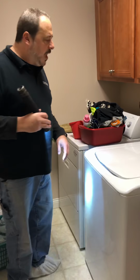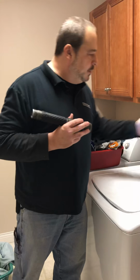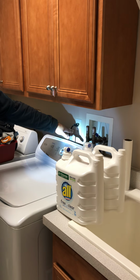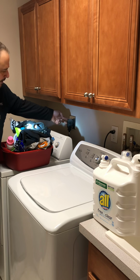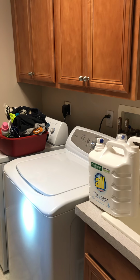We'll go ahead and hit the laundry room here real quick. So I want to make sure that, of course, you do have water flow. If you didn't have these units in here to be able to test, just want to make sure this rotary valve isn't going to be leaking, that you do have actually hot and cold, a grounded outlet, and that there is correct power for the 220. There's going to be 3 legs here. You're going to get 110, 110, and 220 off of that leg. So I would be testing that with just testers other than really having it just plugged in.